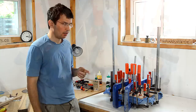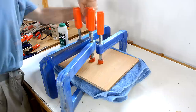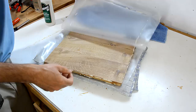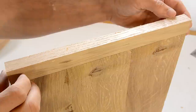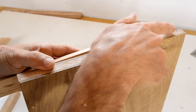I usually go and edit video while I'm waiting for the glue to dry. I've given this two hours, so I think it should be okay to take the clamps off. It looks okay. Here's the finished sandwich with the red oak in the middle. I'm gonna hide that by adding a strip of white oak on the end, and I can get away with that because the oak can't expand and contract in this direction — it's being held in place by the long grain of the red oak in the middle. So that joint should be good.